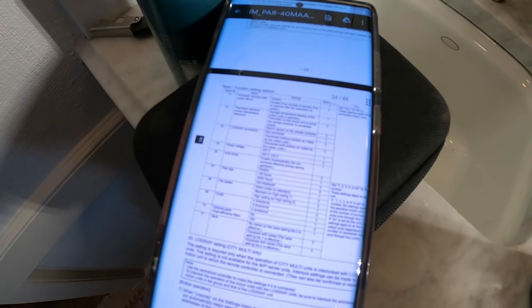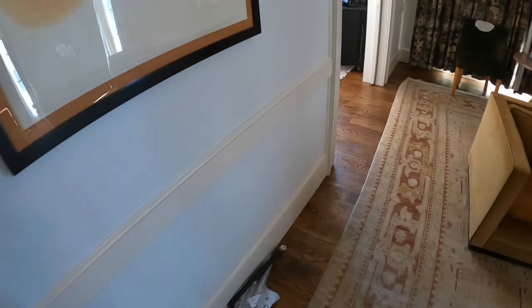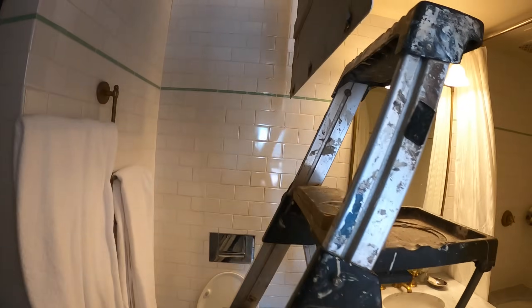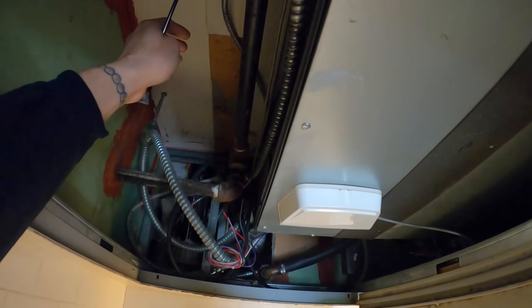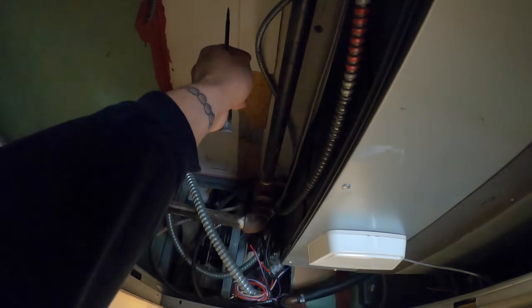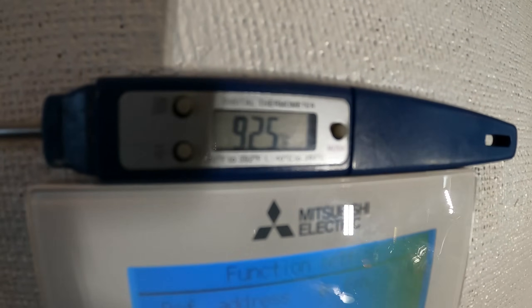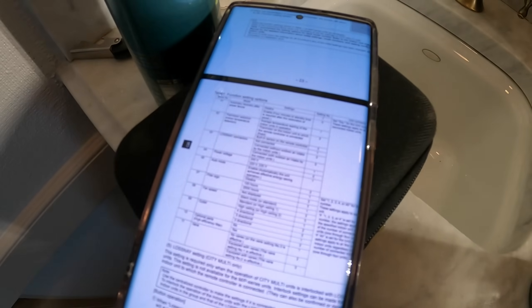That ceiling seems to have a draft — it's not that hot up there. There's no actual air conditioning in the bathroom, just a little return air. When I get into the ceiling, it seems like there may be a draft from holes in the sheetrock with drain pipes and other penetrations. Who knows how well this is sealed off. This area doesn't feel like 95 to 98 degrees — so if the unit is reading temperature from there, that's the problem. I'm reading 92 degrees here. I want it reading temperature here, in the occupied space. So for mode 2, I'm going to switch it to setting 3 — the built-in sensor on the remote controller.